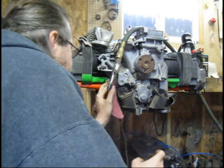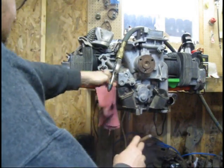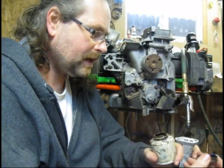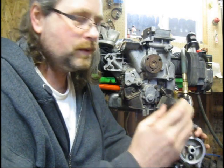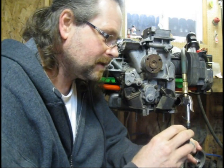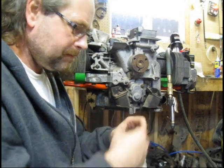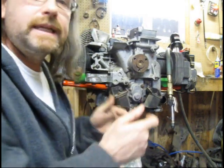I'm not worried about stains on the aluminum as long as I've got a clean surface. If you've never used Permatex Aviation sealant before, a little bit goes a long way and it will run everywhere. My memory card got full so I couldn't finish showing the final coat, but you didn't miss anything. I went ahead and stuck the adapter on and I'm going to get it tightened down now.